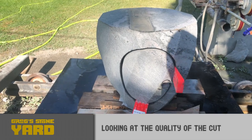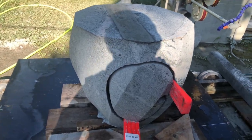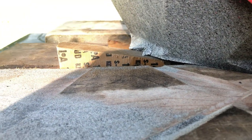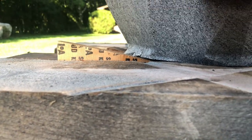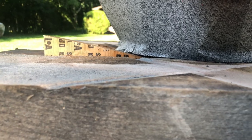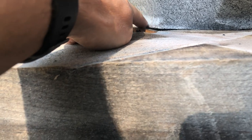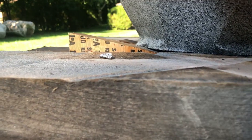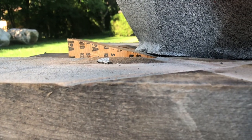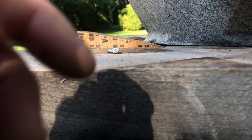So here's how it looks after coming off the saw for the first rotary cut. Got one small problem. You can see it started to move up before it had finished cutting in here. So it's this, but there's this radius here that shouldn't be there. So I think I'm going to have to just manually add some feed rate changes at the entry to the cuts.